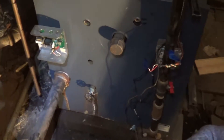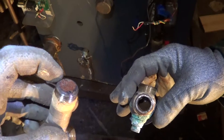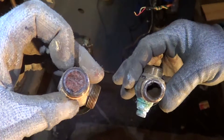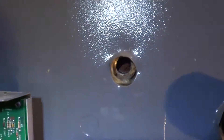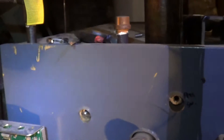I'm breaking this boiler down here and pulled the sight glass. And then look at this — this was the top of the sight glass. It's totally packed with rust. Not any chance of — even you can see in there — of that level reading accurately. And that rust is from the heat exchanger as it was rusting apart.